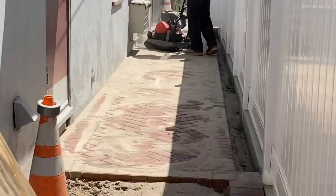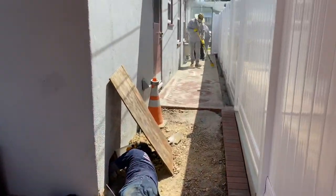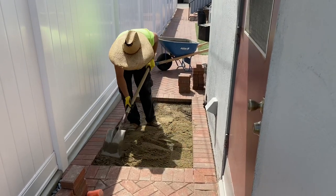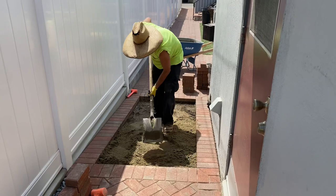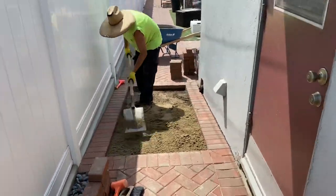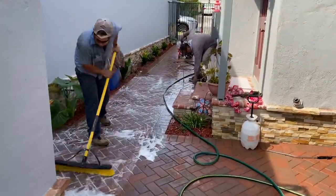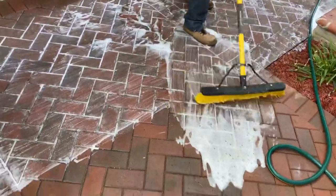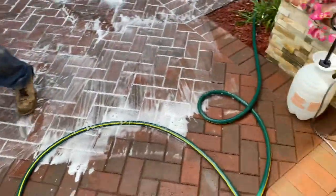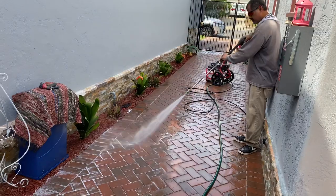Josh is compacting down these pavers with polymeric sand. We got that paver floor done, and there's Arturo the plumber raising that sewer pipe clean-out drain — we had to raise the floor so he had to raise the pipe since it was too low. You can see the vinyl fence done, the curb already brushed hard and nice — divided. We always do the paver borders first to get the elevations right, then add in the paver inlay to complete it, and it works out nicely. The video jumps here — you can see some veneer stone, some wainscot top on top of that, and the brick top on the steps. We did all that. Here Father Vega is washing the pavers.